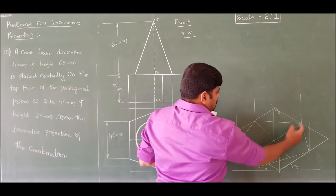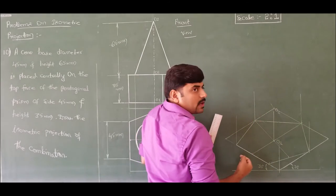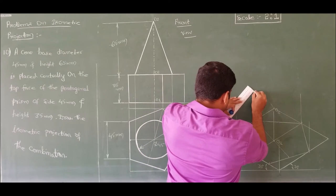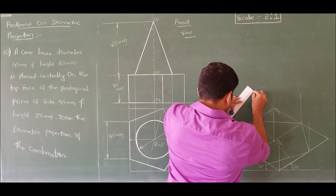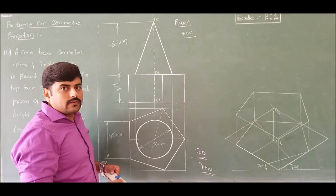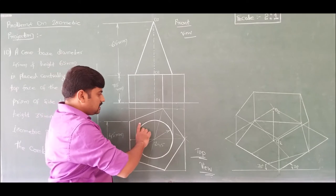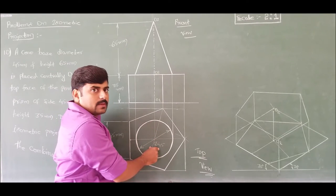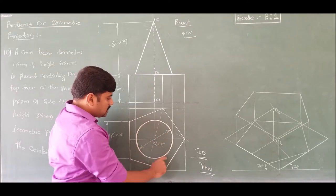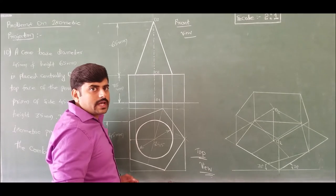Now join these 5 corners, which we have obtained by drawing the 3.5 box vertical lines, to complete the isometric projection of the pentagonal prism. Now taking center O2 as reference, I should draw a circle of diameter 45 mm. So therefore, if I enclose this 45 mm diameter circle in a square, I will get a square of dimension 45 mm